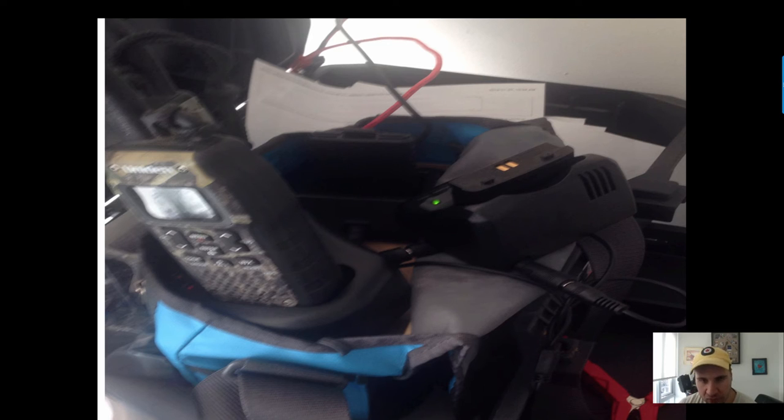One of the issues though is when you build a battery pack, all your batteries have to be pretty much the same energy. Because I've used this battery in different things, recharging it to see what would work for the battery pack, I cannot really use it in my battery pack. So I was considering, okay, what can I do to use it?